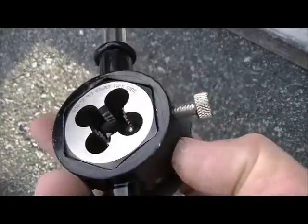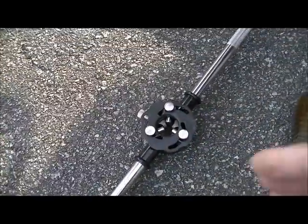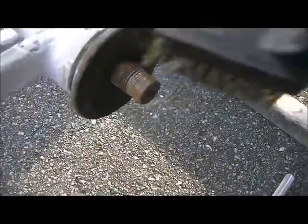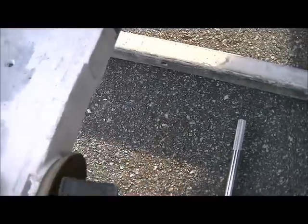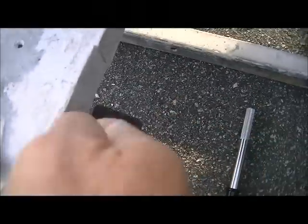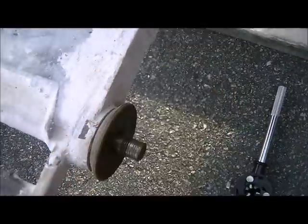I don't know why I ended up with an adjustable — I got it at Napa and that's what they sold me. Another thing about cutting metal is you have to use some type of oil. I have WD-40, so I'll be oiling this up, plus I'm going to scrub off the little excess rust. It's kind of interesting to put threads on something that never had threads on it. If there are machinists or DIY guys out there, you probably think this is pretty elementary and I'm most likely making some mistakes — but this is not my expertise.